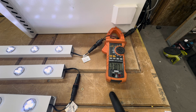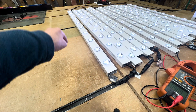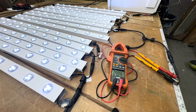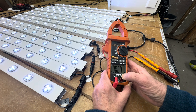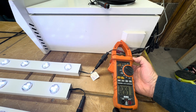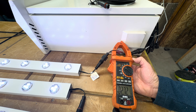I put power injection into the back side of the lights right at the 150th puck. It's all doing perfectly — really good, nice pure white color. The voltage at roughly the middle, about 80 lights from the controller and then 70 after that, is 9 volts. With power injection, the current measurement is 2.7 amps — perfectly acceptable at 100% white with 150 lights.